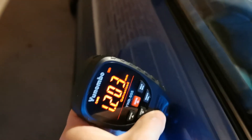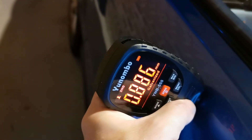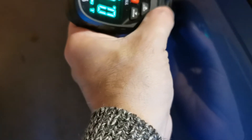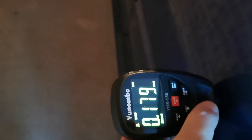It's a curved space - you've just got to be able to lay it flat. 0.8 - wow. Actually wait - 0.1, 0.1. The problem is me not laying the gauge flat on a curved area. There we go: 0.1. This is the kind of depth I expect from factory paint. Green - good.